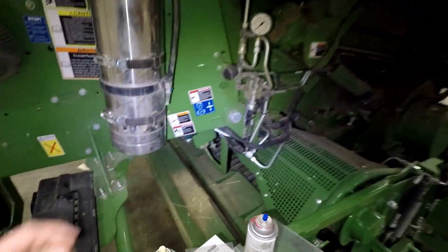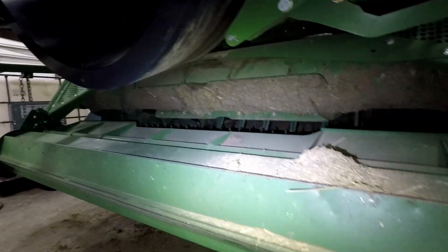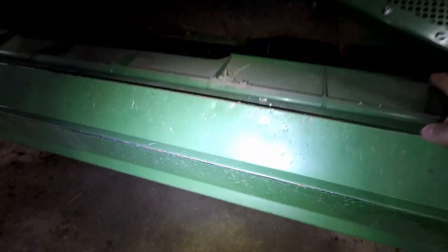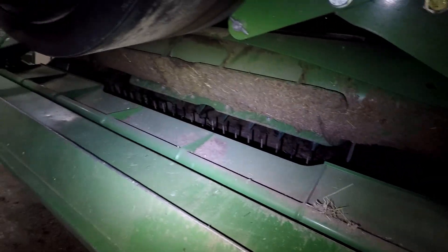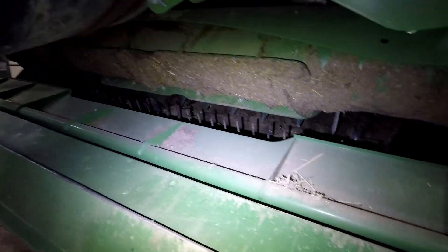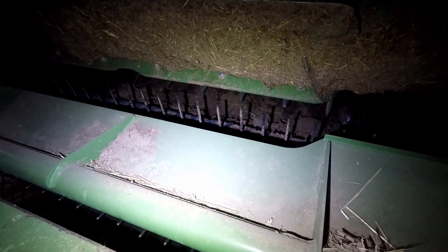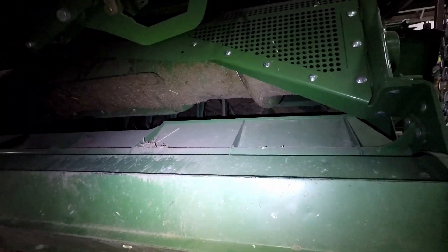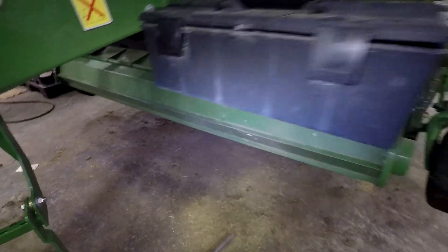Coming around, here is your brake lever. We got our pickup attachment. Looking up the throat of this thing, it is very, very small and condensed. Here is our compression roller. We go through a little panel back there, and then we've got a roller on top to keep the bunching down. So our hay is actually going to go underneath that roller right there onto our stuffer fingers in the back. This thing has not been cleaned yet — they just got done servicing it, so they're going to clean it and put it on the line.